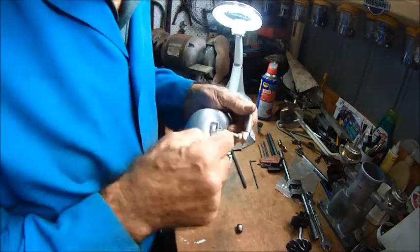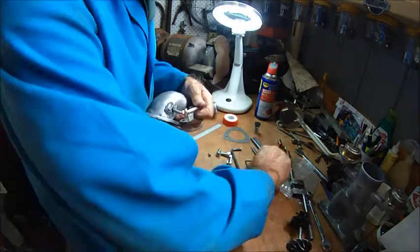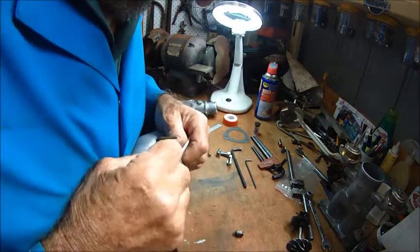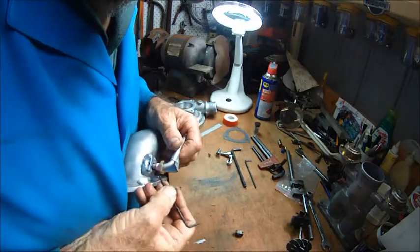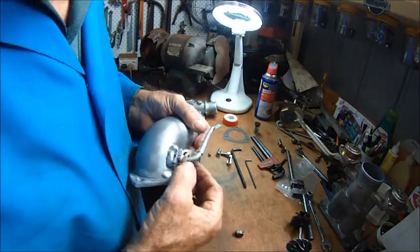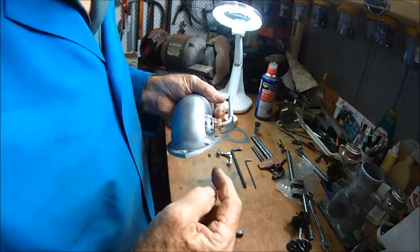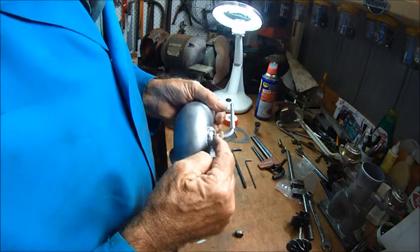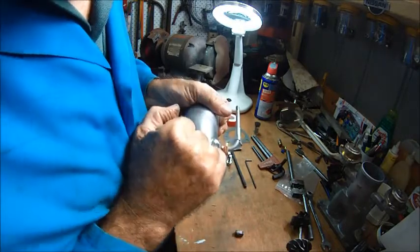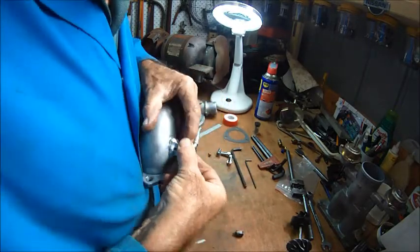The o-rings are going to seal to make that a dust-proof seal. Now that's got an internal thread on it which is 1/8th NPT, and you will notice this nut I made — this is all made out of bits and pieces that you can buy. This was a 1/8th NPT to half inch adapter which was just cut, and you'll see I've got a little cutout in there. Basically what's going to happen is this is going to be screwed in.